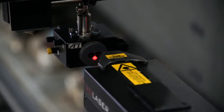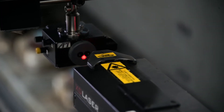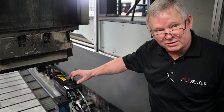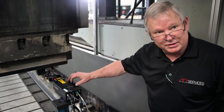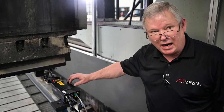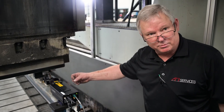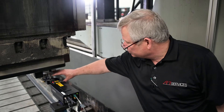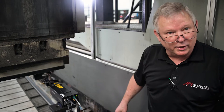The reason that mirror is there is that as we start our process and get it pretty close, that mirror is going to reflect that beam back into the XD laser. In order for the angle or the laser intensity to be accurate enough for us to get good accurate measurements, we need to have that mirror adjusted so that the beam goes right back in the hole where it comes out of.